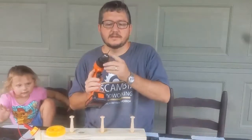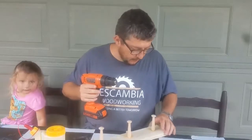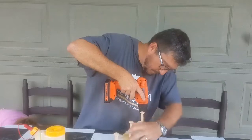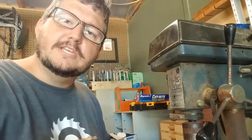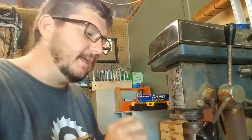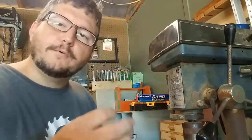I've taken a small drill bit and I'm just going to drill a pilot hole here for a screw. I've set a 3/8 Forstner bit into the drill press and lined everything up to set the depth. Now we're just going to drill the top of the hole out big enough for the head of a screw to fit in and for the plug itself.